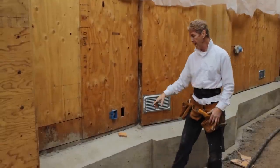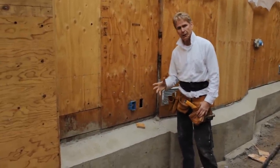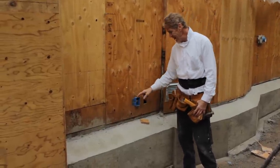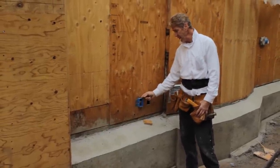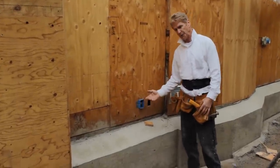so we can't work here, but we're working together with everybody. How thick does stucco have to be? 7/8 of an inch. What if it's an inch? No big deal. It's not going to be seen. This box right here has to come out 7/8. It's 2 inches, so I'll have to tell the guys, hey, you got to inset this for 7/8 of an inch.